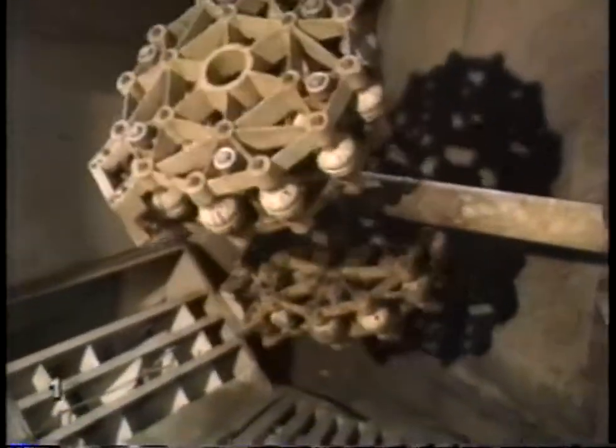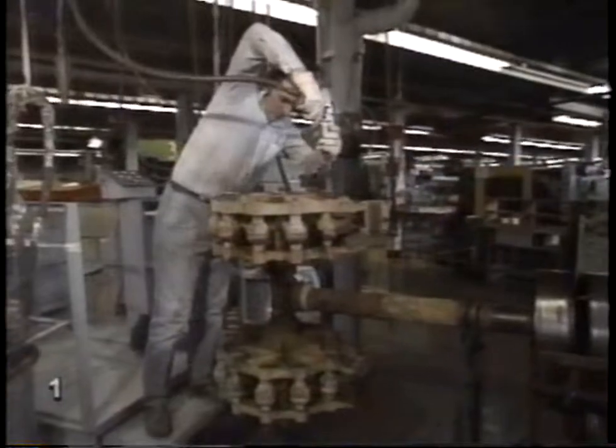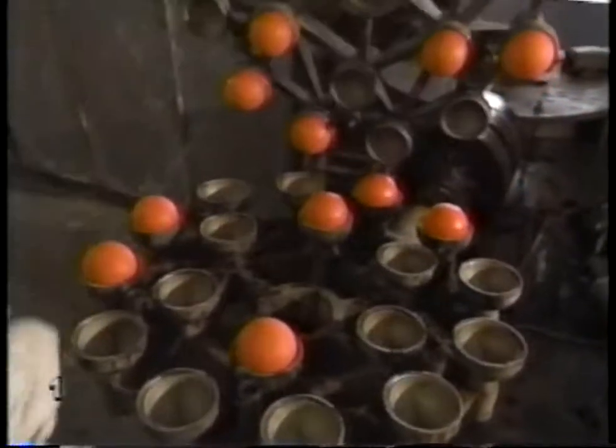Now, another kind of ball maker. I know, it looks like something from outer space. This machine makes hundreds of balls every hour. First, liquid plastic is poured into these little cups. The cover is bolted down so the plastic can't escape. Then the arm goes into the oven and turns over and over — the liquid plastic is forced against the sides of the molds, like those carnival rides when you're pushed against the outside walls and just held there. That's the idea. Here comes the arm out of the oven. It's cooled down quickly. After ten minutes, the plastic is good and hard. The molds are opened and out come more bright orange balls.